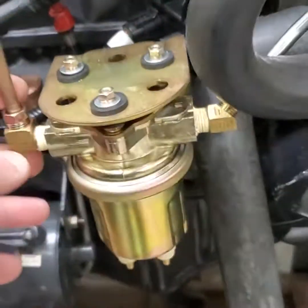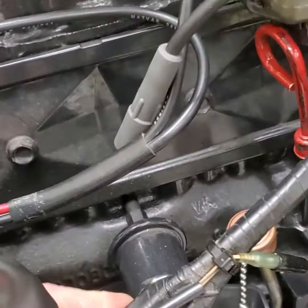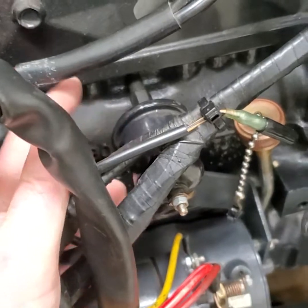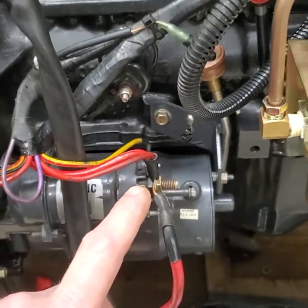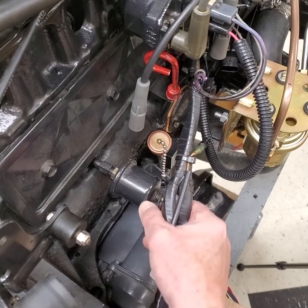Nice bends on that. I've got my stainless original one still in place that I fabricated - I'll probably change that over to copper-nickel. The oil pressure sending unit is here and it threads into the block with an adapter. What I'm going to do is take this sending unit out, put a T fitting in, put the sending unit on one side and an oil pressure switch on the other side, then wire that through a relay, and that relay is going to send power to the pump.